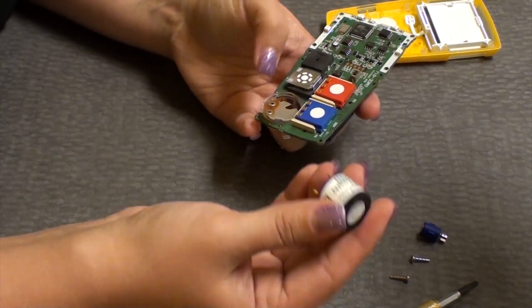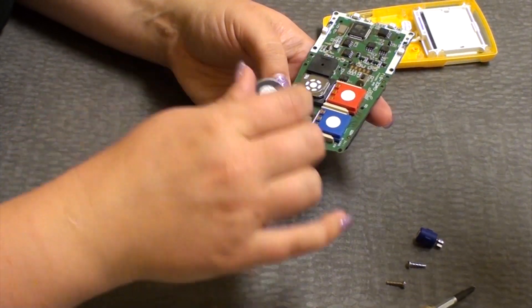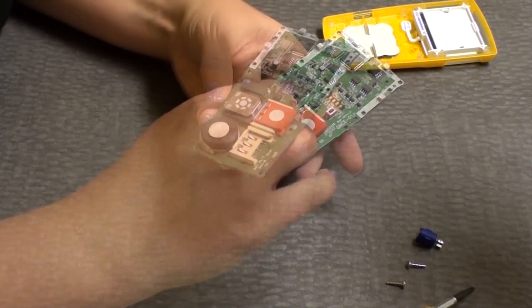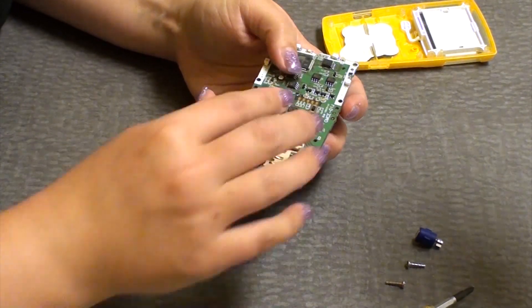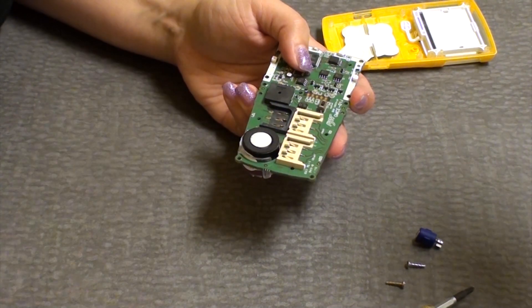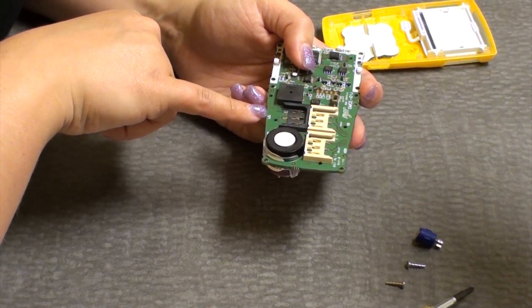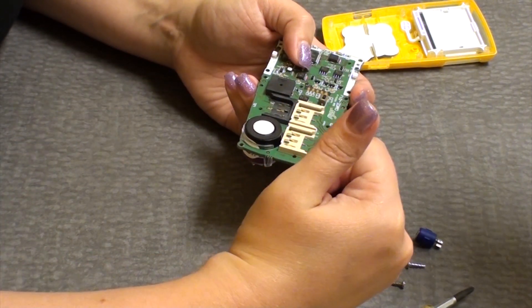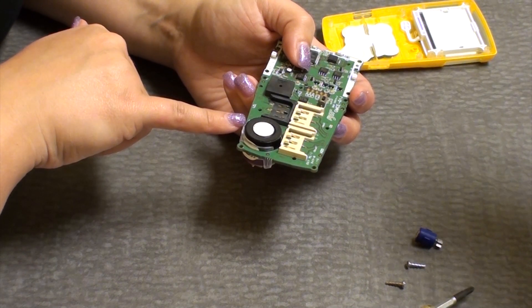The big round one is your oxygen sensor. It pops out just like that. Pins go in the holes. One other thing to note is the PCB board is marked with the sensor type, so it'll tell you where the H2S, CO, LEL, and O2 sensors go.